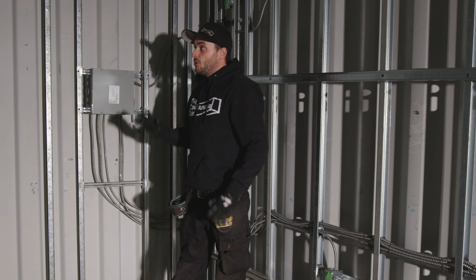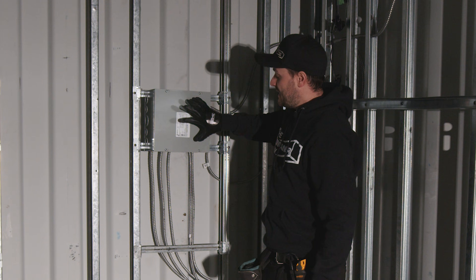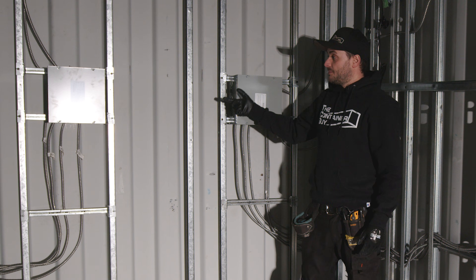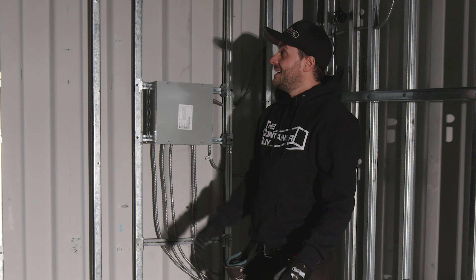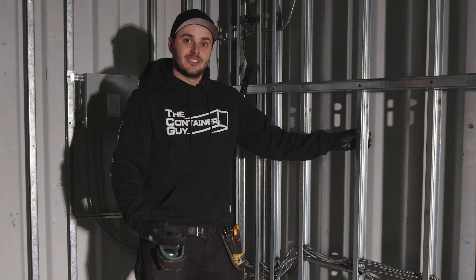There was a piece of plywood here in the panel — we switched that out to these two junction boxes. They've got covers, and all the wires are spooled up inside, coming in from the back. We're going to be able to get spray foam all in behind here. Once that's all done, we put the panel back on after spray foam, come right out of these into the panel, and you won't see any wires. You'll be able to plywood up to all of this, install your panel on the plywood, and everything should pass code. If we cut the studs at the right place where all the circular holes line up, we can pipe through all the studs into handy boxes — that's probably the only way to really get electrical inside your framing and have it perform the way we want.